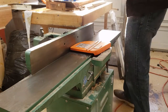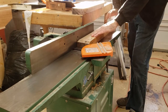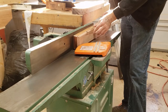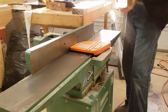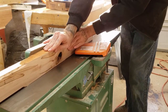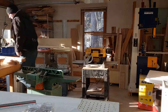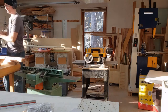So even if the board was perfectly square — an inch thick by three inches wide and everything was great — if the board sits in a position it's not supposed to, it can change. So you have to continuously mill stuff to make sure everything is square and good to go. You'll see on this next pass it gets hollow in the center. Listen. So this board has a slight crook in it. Now take the second pass. Nice and clean all the way through — what it missed the first time was a little bit of gap in the board. The blade is making contact with the wood all the way along the surface, so it's going to be totally flat.